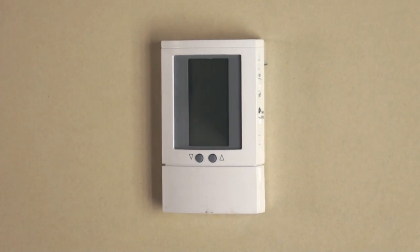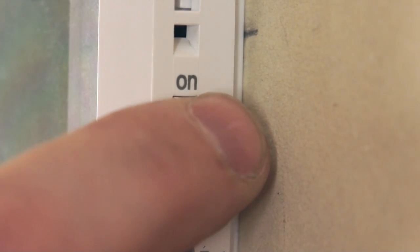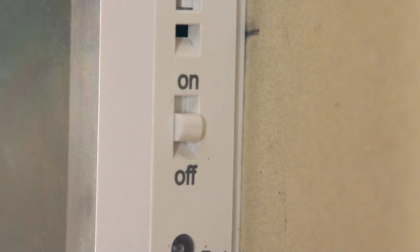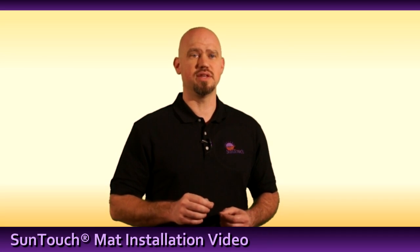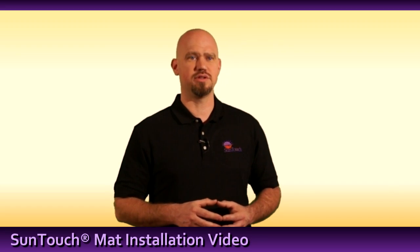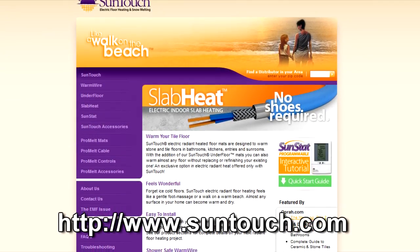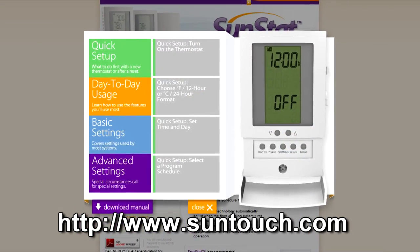At this time, briefly turn on the SunStat to test the system. Do not leave the thermostat on for an extended period of time. Doing so may compromise the thinset during the curing process. Refer to the thinset manufacturer's recommendations for minimum cure times. A SunStat Quick Start Manual and an interactive tutorial can be found on our website.